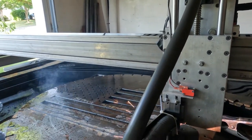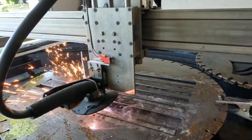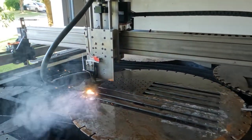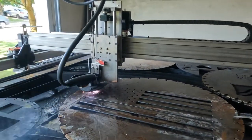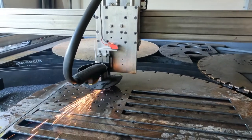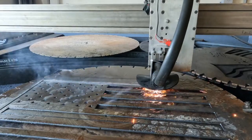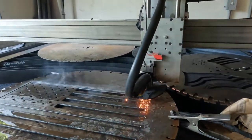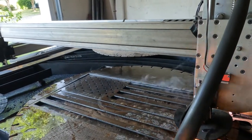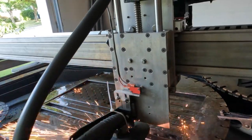It's finishing up the cuts here — finishing one of the stripes. When you think about this plasma process, it's pretty amazing. It's a DC current that the machine applies; that DC current sparks over compressed air and actually vaporizes the metal — that's not an exaggeration, that's exactly what it does. That plasma arc is something like 10,000 to 20,000 degrees, and it just vaporizes the steel.